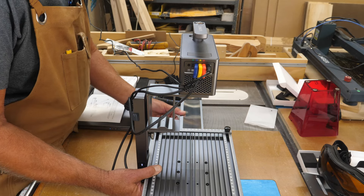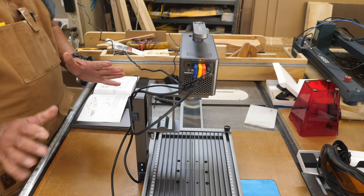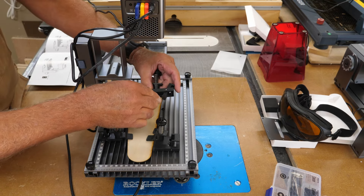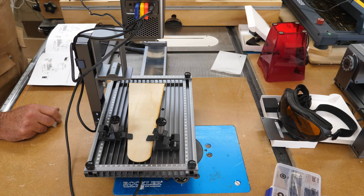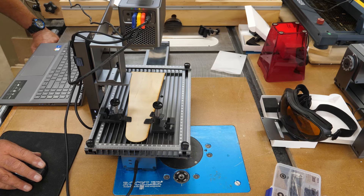Moving the slide until the dots are positioned correctly. This comes with hold-down clamps — you squeeze the spring tension and then turn the knobs to tighten down your material. I've just got a scrap in there for testing. I've set my focus here, but homing is disabled, so I actually have to move the slide manually.